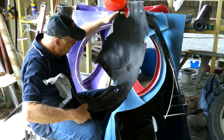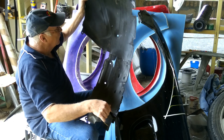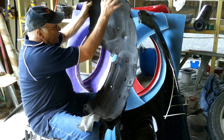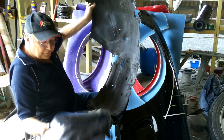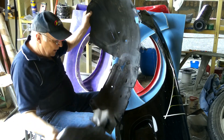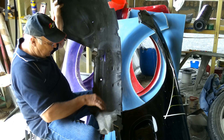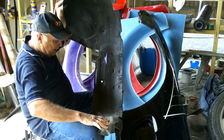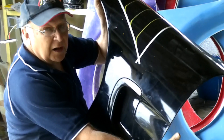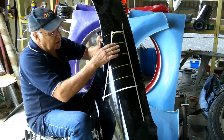These are the plastic inner linings off the mud guards — the factory component. Wide tyres tend to catch and rub them, so a lot of guys who do track work remove them. The problem is that lets all the dirt into the engine bay. So what I've done is made up fibreglass short versions that just go on the front. They keep the dirt out of the engine bay and give more room for the race tyres on the back two thirds of the wheel arch. But this means air is not going out the wheel arch — it piles up behind the guard.